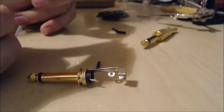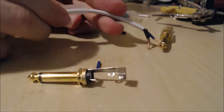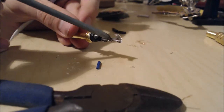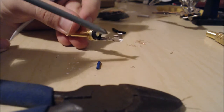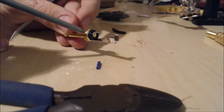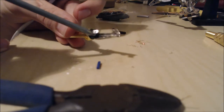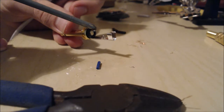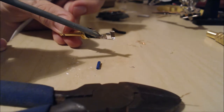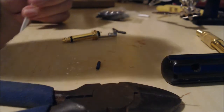Slide over the little plastic cover now, as that'll need to slide back over once the jack is attached. The blue lead is going to sit in the hole here for the negative — sometimes you'll have a hole in the bottom so you can just wrap it around that bit of metal. The tip — the positive — is connected to this little lead here, which is a bit further out, so a slightly longer wire helps to attach it. These jacks may vary depending on brand; I've got really cheap ones from AliExpress.